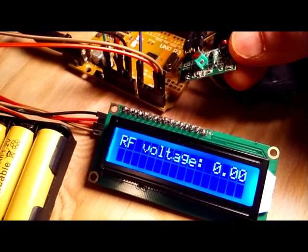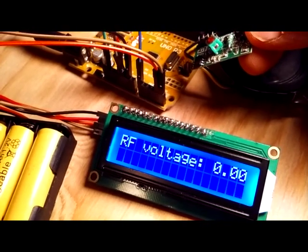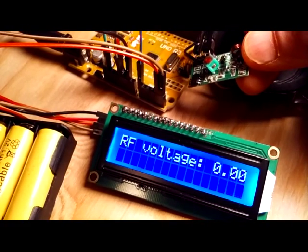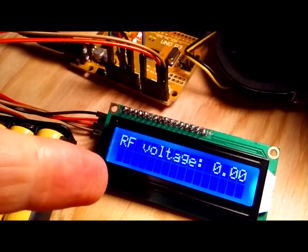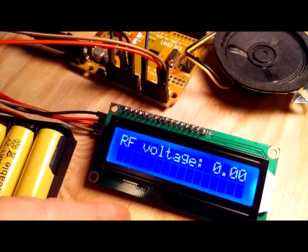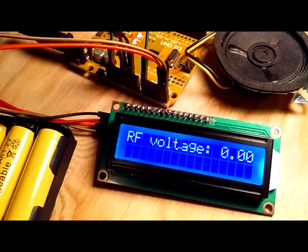Now the signal that's captured on the receiver — the values go from zero to 1023, which maps to zero to five volts respectively. Getting that value and then multiplying it by 0.0049 gives us the voltage of that radio signal. That's what I've got showing here on the LCD screen — pretty neat showing a floating point decimal with the Arduino. Just set your variable to float.